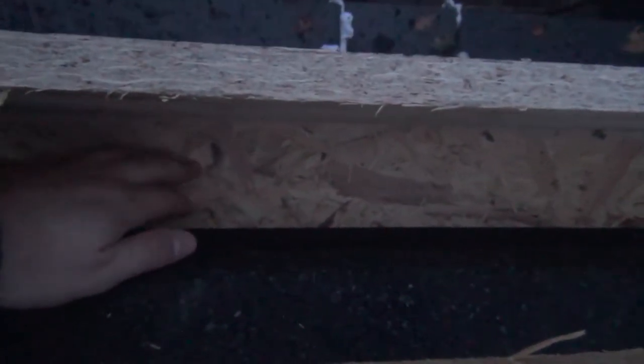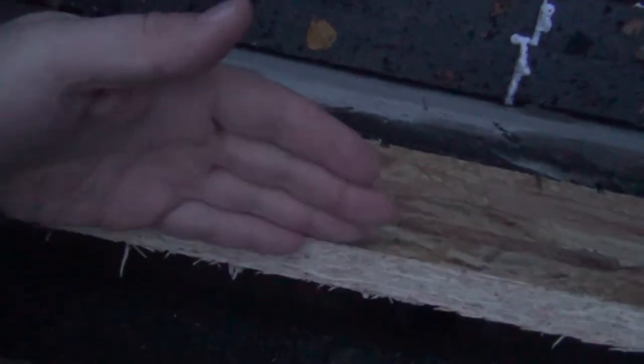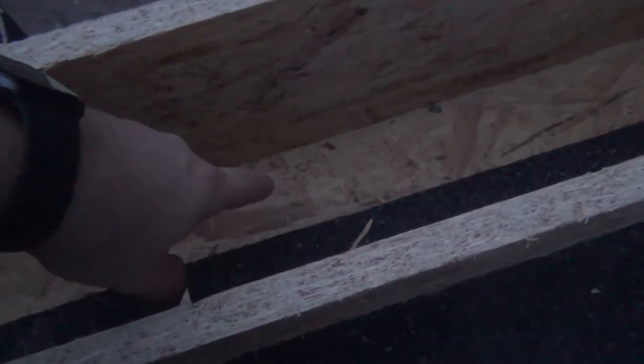When we were doing the thermal insulation for the roof, we put a piece of rock wool on the end — and below this is just concrete covered with tar paper. We're going to have the black styrofoam come up all the way over here and cap it off with some metal sheeting to finish it off for waterproofing. Inside this box we're going to fill it up with rock wool so that the concrete over here gets insulated and stays warm.